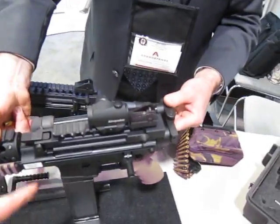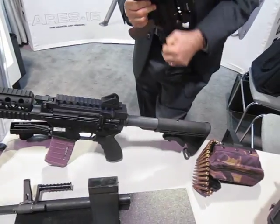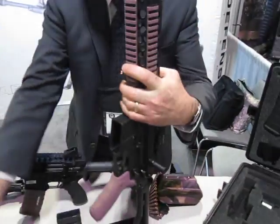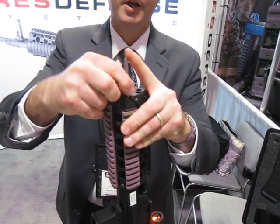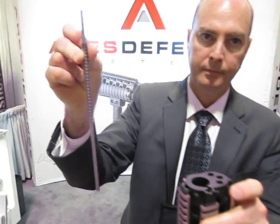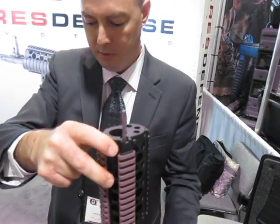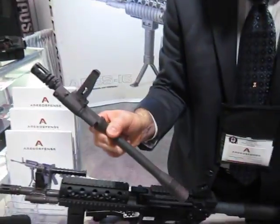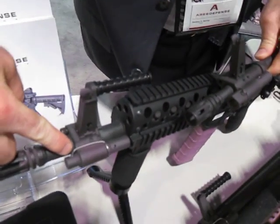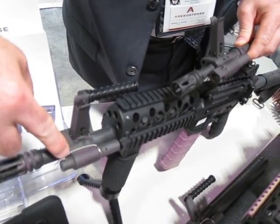This is a family of weapons. This is our lightweight 12-inch barrel. I'm going to remove the operating rod and pull it out right here — that's all there is to it. The piston is actually captive to the barrel. This model right here is a self-regulating assembly, so it's not user-adjustable. It compensates for various ammunitions and temperatures.